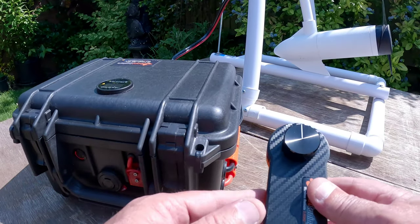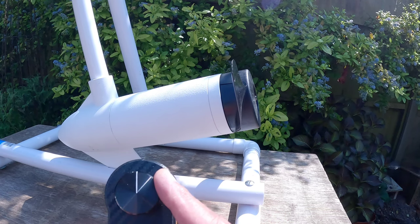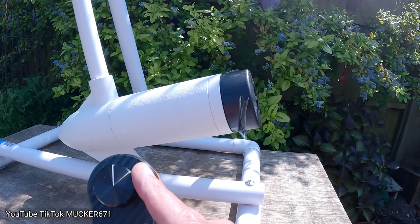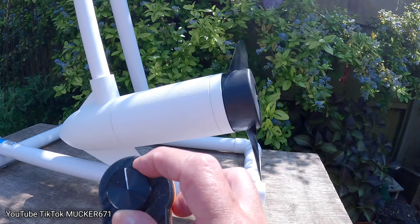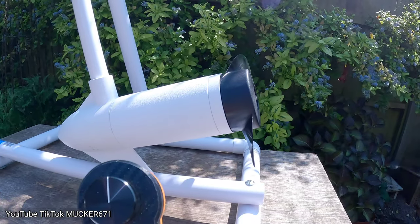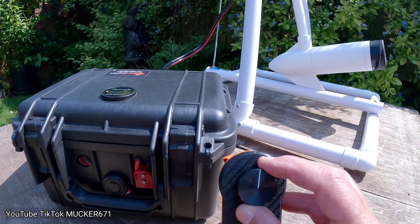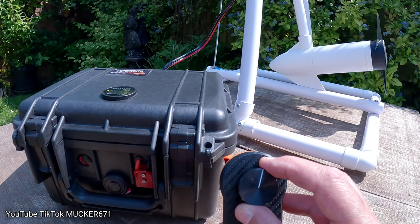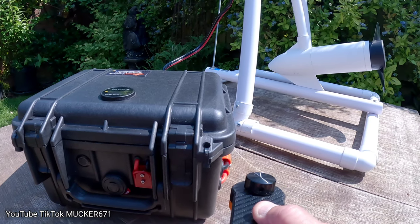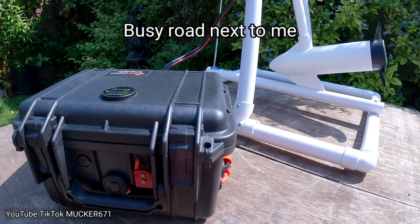Then you turn the power on the box and wait three seconds. Being nearly perfectly stepless gives you so much more control, especially in the flow — sometimes you want to sit still with a knot or two of tide, you can sit in that as long as you like on the river. If you've found a nice spot you can just pop the power up a little bit and sit there. Obviously I'm not going to turn the power up because it's out of the water, but truly stepless — and that's how you turn it off: first you turn the battery off, then the controller off, then unplug the motor.